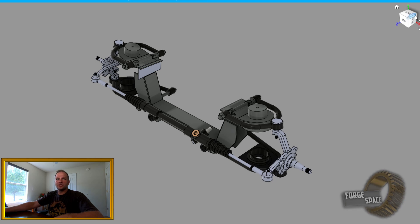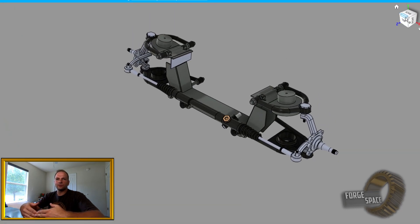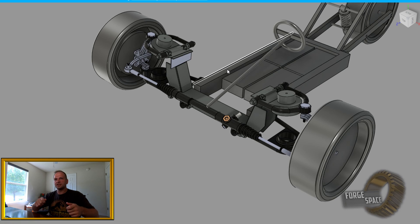After looking around some more I found that Mustang 2 suspension is very versatile, with the same goal of allowing the driver to sit forward more than a conventional suspension, especially since we have no motor in the way. I then stumbled across Crown Victoria suspension. The middle crossmember is all aluminum and the entire suspension is contained within that crossmember section, so everything bolts right up to it — shocks, springs, hubs, brakes, the entire assembly all in one. That's going to let us do an entire aluminum frame built out from the side of it, welded directly onto the two little pillars on the crossmember.